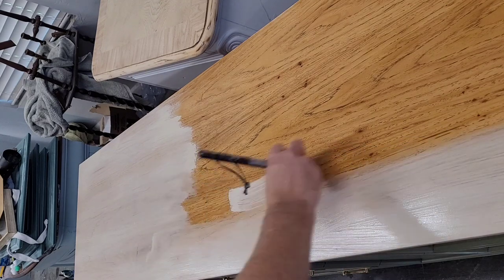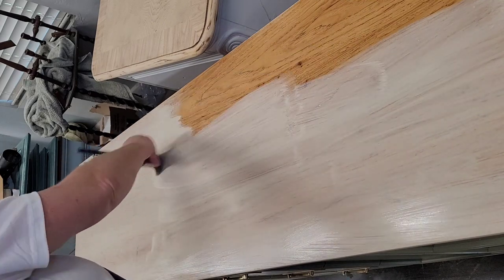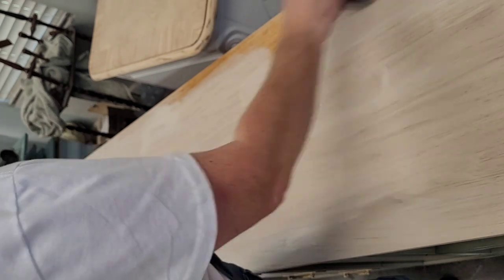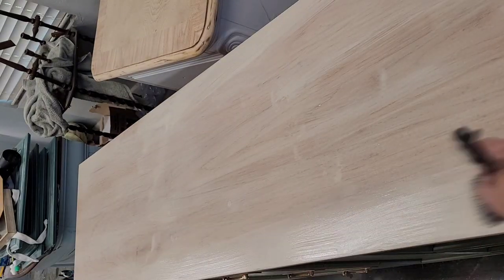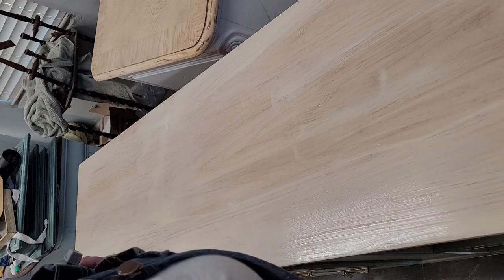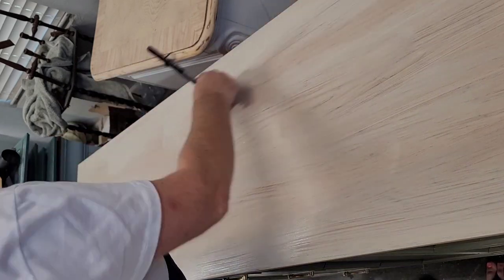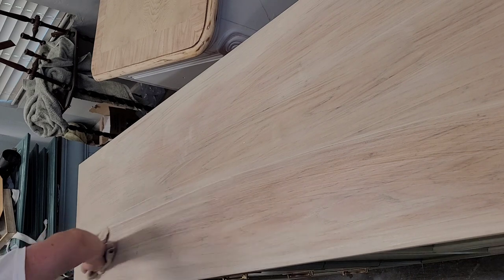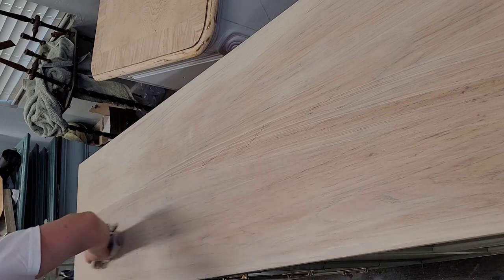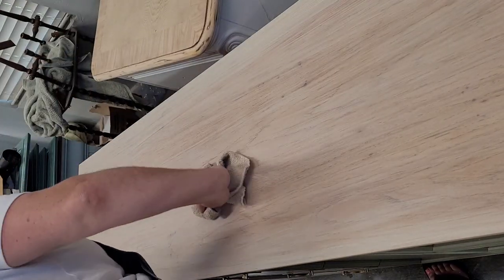Restoration is a light sandy beige color — perfect for whitewashed wood looks. Another option would be a beachy wood stain; either gives pretty equivalent results. I felt this light wood top really complemented the body color. Once I've brushed on a thin layer over the entire top, keeping it wet so the paint can still move, I get it into all the wood grain and give it a minute to absorb. The key is not letting the paint dry, because I need to come back and wipe it back. I wipe in long even linear strokes with a lint-free rag, working from one end to the other, flipping to a clean side as it absorbs paint.